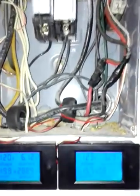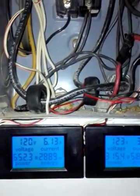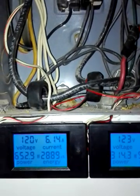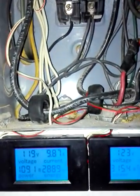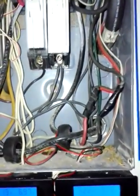The only reason I connect mine this way is because I need to know what's being run on each 120-volt leg, so that when I connect my generator I can actually see and balance out my load in terms of wattage on my generator. I just wanted to give you guys a quick tutorial on how I ran my watt meters.